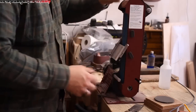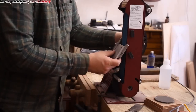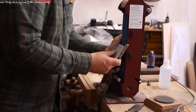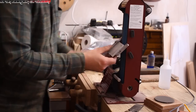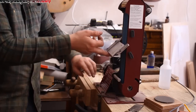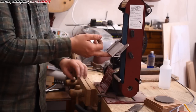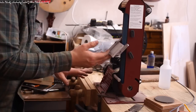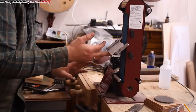Basically you have a quick-release system — it's fast to change the belt. And you've also got an easy system on the side with a bunch of holes and an in-built wrench. You can change the angle to whatever you like. On the front of the tool it says the top hole is 15 degrees, then it goes 15, 20, 25, 30, and it even tells you what those angles are used for. This wasn't really meant to be an advert for the Pro Edge, but frankly it's an amazing machine, and if you can afford to go for top quality, you just can't be beat.